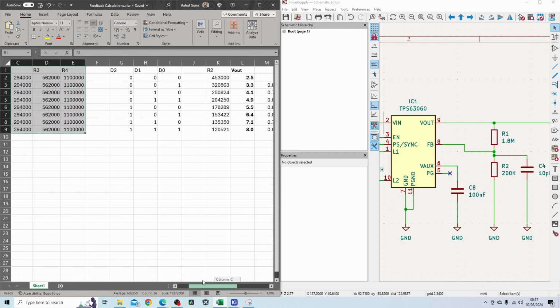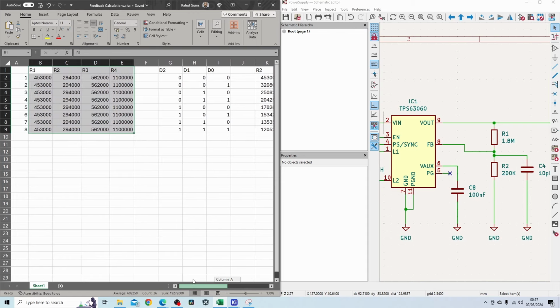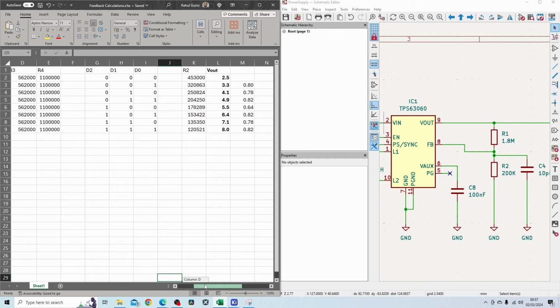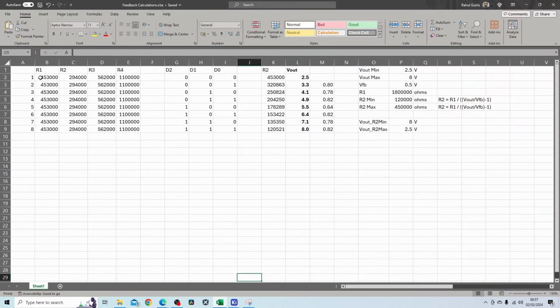Now I'm thinking to do this by adding a BJT with a series resistor, and the BJT would be controlled by a microcontroller. I'm not 100% sure if that's going to play havoc on the control algorithm and make the output unstable. So what I will do is add a bypass, using just the 200k resistor. So in case it doesn't work, I'll bypass all of the circuit using a 200k resistor. But these are the resistors that I am thinking to add in.